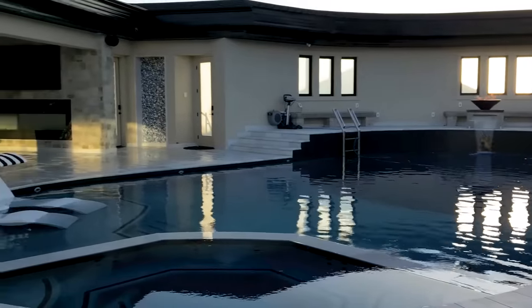Any failure in the system, including what if the shower was running when the power went out and my generator didn't fire and my backup generator didn't fire and I really actually lost power? Well, the valves have internal capacitors that can hold power, and if one senses that happens, they both revert, which will automatically turn off the shower and winterize it if I lost power somehow. So there are backups if my generator system didn't work while the shower was in operation.